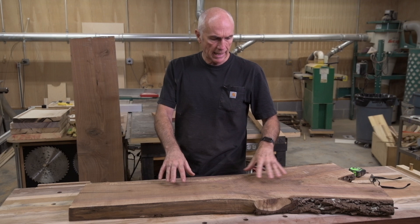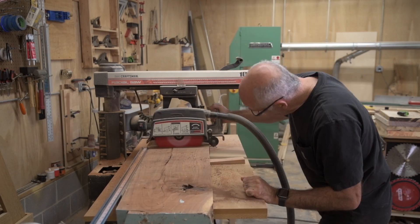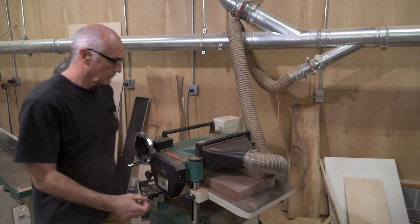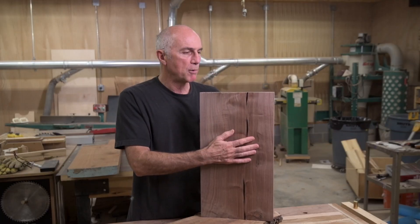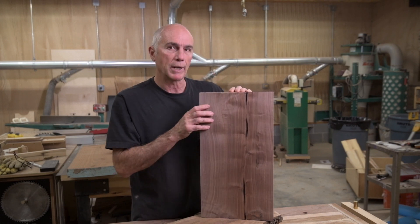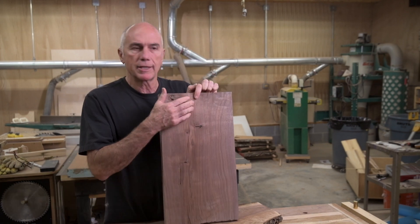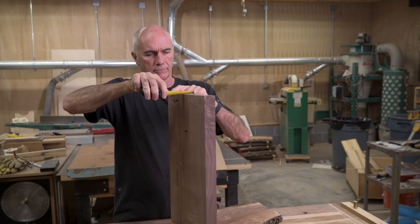The top is going to be the last thing I do. I need to get a 16 to 18 inch piece out of here. I've got my piece all squared up — it's smooth on both sides, still a little bit long, I need to cut it to length. I also have this line going right through it. This is the very center of the tree, or the pith, and I don't want it there. So I'm going to keep planing it to get rid of that. It's just a little bit too tall for me to cut on my bandsaw, so back to the planer for a few more minutes. The pith is gone — well, almost. I don't think I want to take it down anymore, so let's make it an inch and a half.